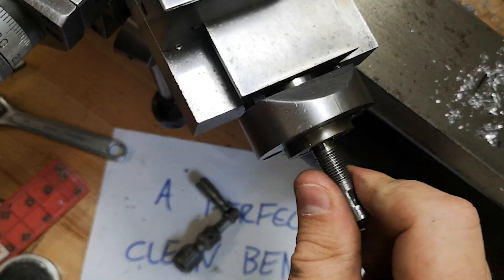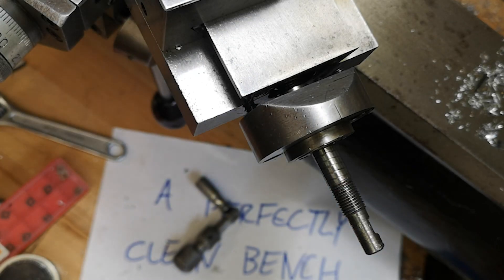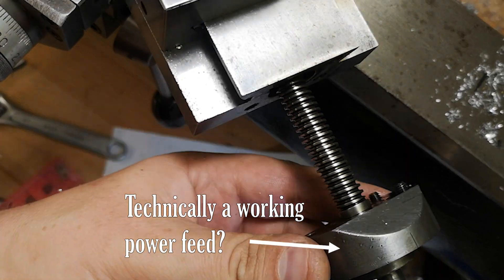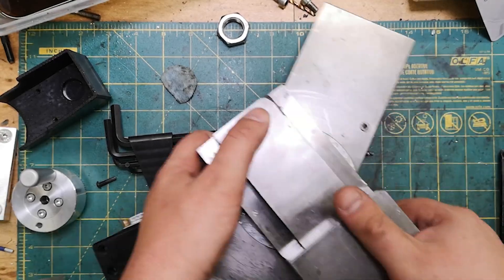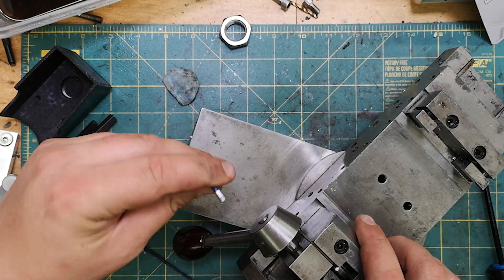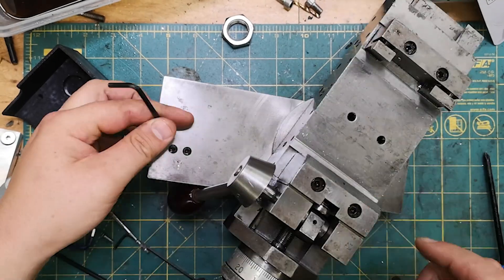At the very least, with all the mechanical parts done, we can put things together, which is still the fun part. Before I can install my system, I've got some maintenance to do. The cross slide nut is actually broken, which makes it quite backlash-y, but it's also loose, which makes it extremely backlash-y, so I'd like to tighten it up at least. A little bit of backlash on a manual machine isn't the end of the world, and my new system should account for it, but it's about 50 thousandths of an inch right now, which is pretty excessive — about half a handle rotation. I'm not going to make a new nut for the machine today, but I'm at least going to tighten it up a little bit.